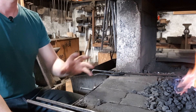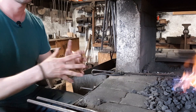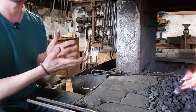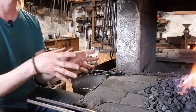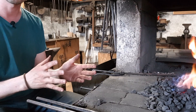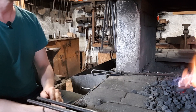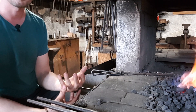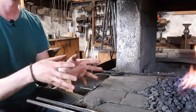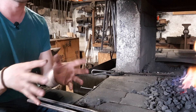Depending on what kind of tool or equipment you're making, you will want different hardness levels. A kitchen knife, for example — you want it very hard to keep sharpness, so you might just go to the yellow color around 220 degrees Celsius. And for a hammer, which you'll be striking things with, you might want softer hardness, going to around 280–290 degrees Celsius.